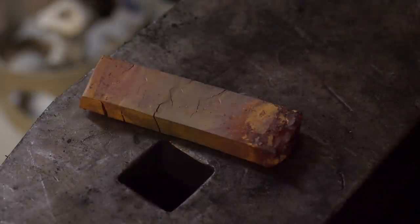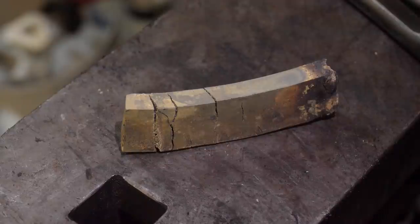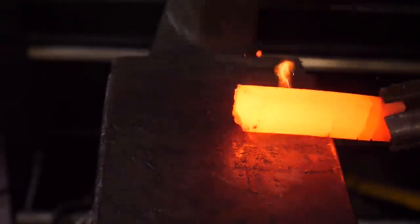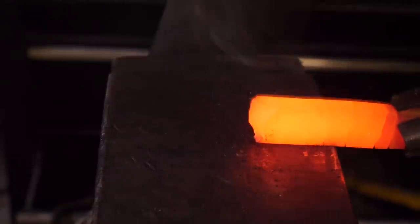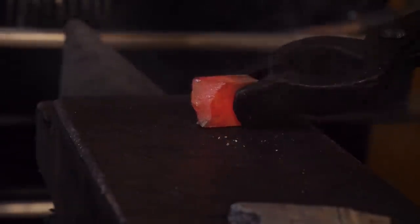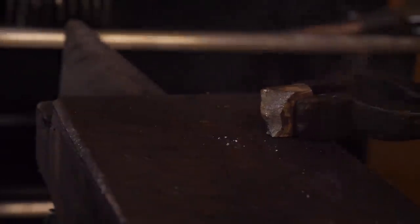I'm very curious as to why the front half cracked more than the back half. Look at all that oxidation — all that yellow stuff — off of just one heat. It's amazing. I tried forging on the anvil and it cracked along lines we'd previously put in there. My sense is I didn't form any new cracks on the anvil, but it didn't move at all — it's like hitting cold metal. I tried forging at slightly cooler temperatures just to see what happens, maybe avoid some oxidation, but it's still breaking up along previous cracks. At this point I'm just putting marks in my anvil.